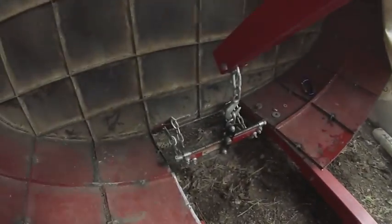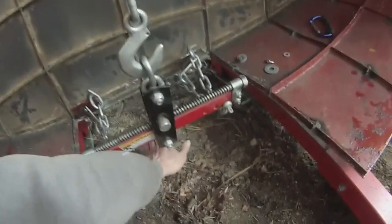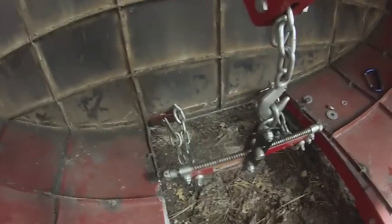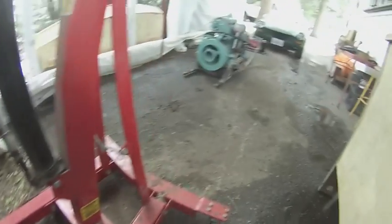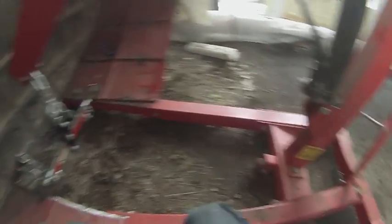So I'm going to have to raise this up. I made a cutout as well. The reason for that is because I'm going to sink the engine in about 6 inches, so the engine stand at least will be about 6 inches below the bottom of the hull — just to lower the center of gravity, hopefully use the engine as part of the ballast, and also to put the propeller as low in the water as possible.